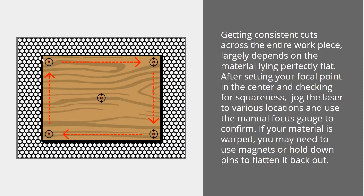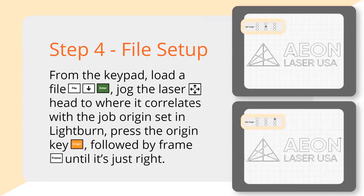We do level the table before sending it to you, but the honeycomb isn't a perfectly machined piece — it won't be the same distance in the middle where it's softer and has less reinforcement than on the edges. It's always going to be plus or minus a little bit. Within a millimeter you can usually count on a good cut, but beyond that you may want to adjust. I often see people getting good cuts on one side of the table but not the other — if you've double-checked the distances and they're equal, you're probably dealing with an alignment issue where you're losing power on one side.